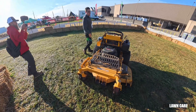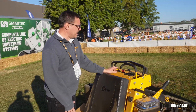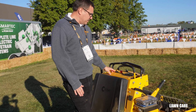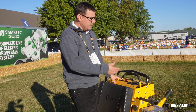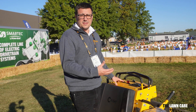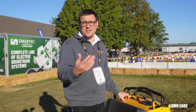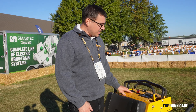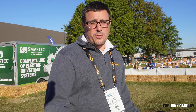Coming around back here, they've set this machine up with multiple options. If I switch this over here, the display panel tells me it's in engine power mode — so if I turn the blade on, the engine's going to come on right away. In the middle setting, it's automatic — the engine will come on as needed and shut off if it's not needed. And I can also select EV mode, which forces the engine not to come on. Maybe you go on a property where you want it extra quiet and simply run on the battery — you'll get about 30 minutes in that mode. Then next job, put it in auto and the battery would self-charge up again.